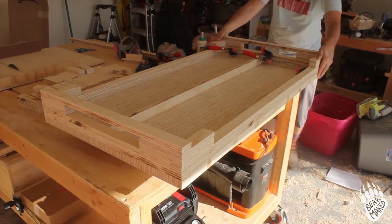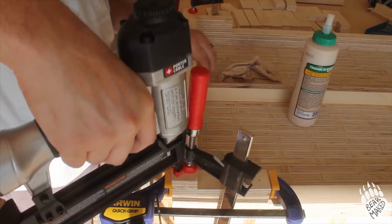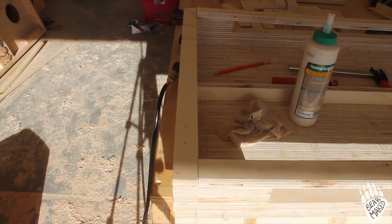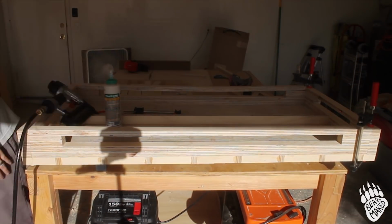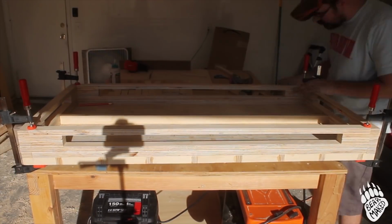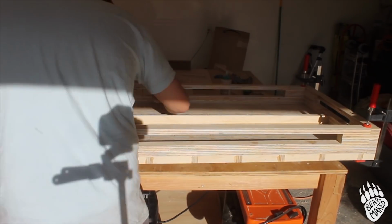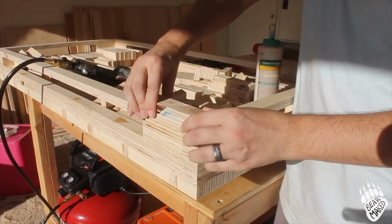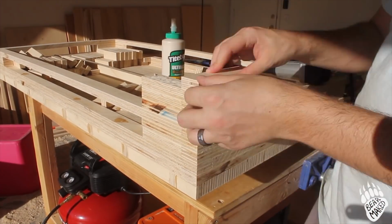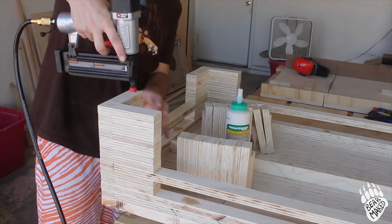And this is when I just started building up the leg sections, and then to be sure they don't splay out and they're nice and sturdy, I just used a long piece across each side. And then I'll do that again when I get closer to the floor side of the table, just as more reinforcement to make sure that the legs stay nice and vertical and they don't want to rack side to side. And here you can just kind of see how I built up the legs to make sure they were nice and structurally sound, or the leg sections anyway.